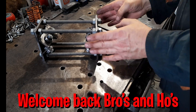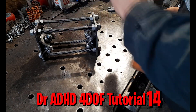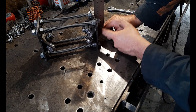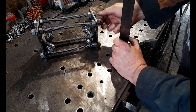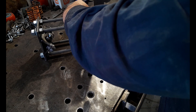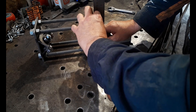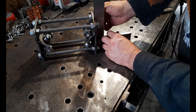When it comes time for this to become permanent after you've painted, you can simply get your trolley on a nice flat surface, grab a square, and use your square against your trolley to get your plates square. You'll need to do this — it'll be fiddly — in conjunction with getting the spacing correct with the other side. Get it in the ballpark on your rails first, then take it off the rails and fine-tune it on a nice flat surface.